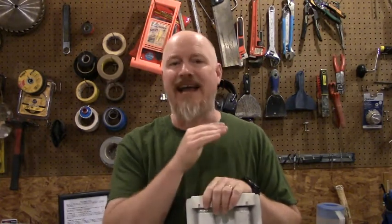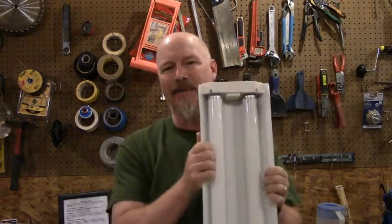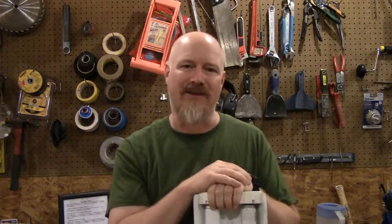Today we're going to be talking about power and lighting. When we purchased Redbud, we had all sorts of these bar fluorescent lights all over the basement. In talking with an electrician, he said that you should do away with those and replace those with the compact fluorescent bulbs. You'd have redundancy, less power usage, easier to maintain.